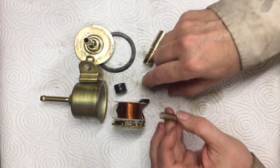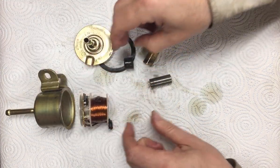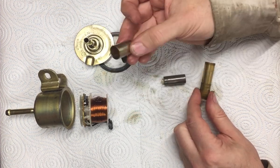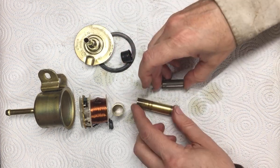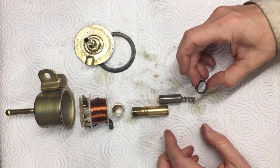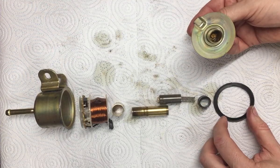So yeah, that's what's inside a tick-tick pump if I line it up. So there's the output, there's the electronics and the coil. This you would call in a drill a torque ring. It's just way better at amplifying the magnetic field through this brass tube. Piston goes in there, spring goes up the inside, a rubber seal, final output rubber seal, and then the input housing with the inlet valve.